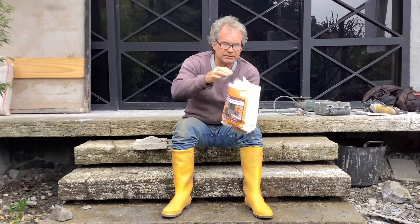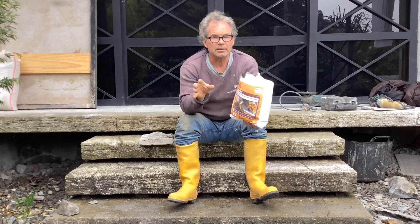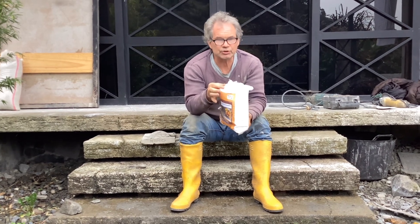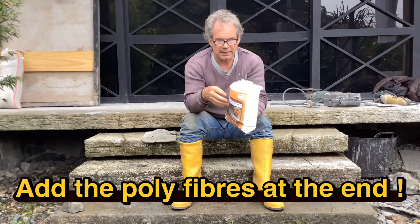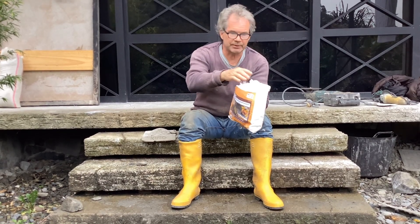So the process: you put your water in your mixer or cement mixer, then mix all your components — sand, cement, water, whatever other chemicals you put in there. You add the fiber at the end, near the end. Because if you put it in with the water, it gets chewed up too much — distributed too much and damaged as well. You want the fibers to remain as an accordion, not as single fibers. Put it at the end and you'll get much better results.